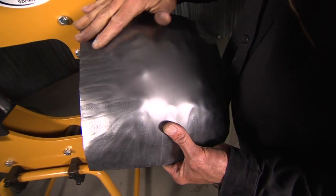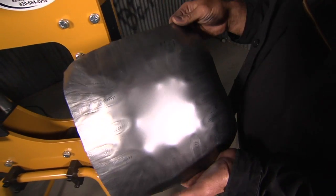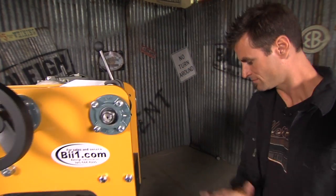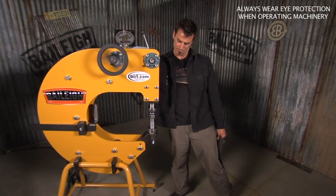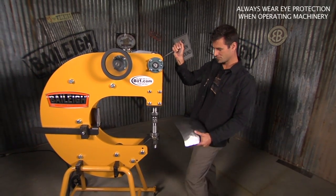We did a lot of shrinking with a thumbnail die. They've got a nice little small thumbnail die. Uses all the same dies that they use on their big multi-hammer. So at that point, let's show you some doming. And I think after that, maybe we'll show you some beading. So you just flip on the switch. Pull it up just for giggles.